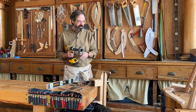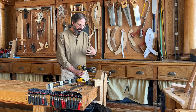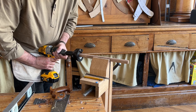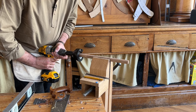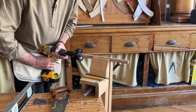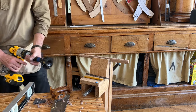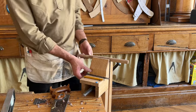I've got the tenon cutter and a piece of stock, and I'm going to set up to drill a full length tenon. I've leveled the stick in the vise, leveled the drill using the bubble level, and sighted here to make sure this is 90 degrees. Then I press hard forward into the stick and do a couple of rotations to make sure I'm level. When it stops cutting, it has reached the bottom of the tenon cutter.